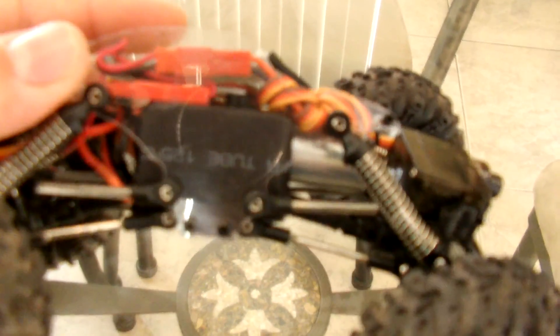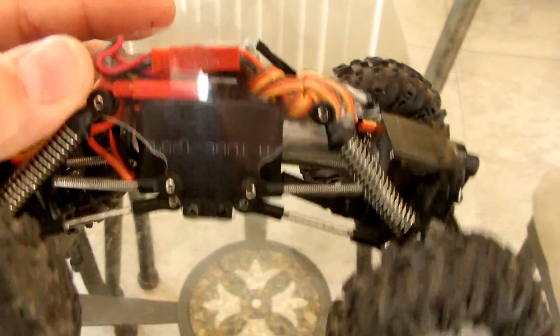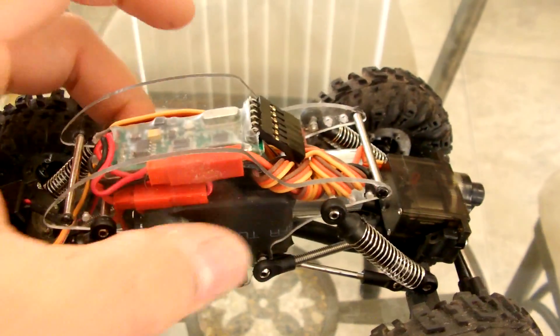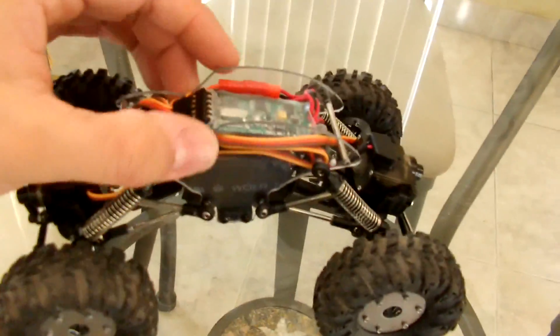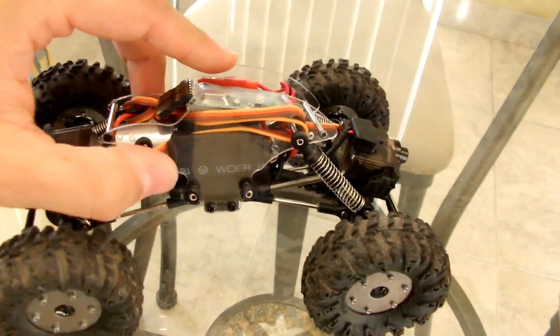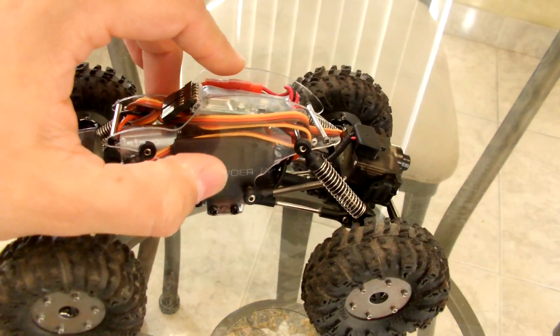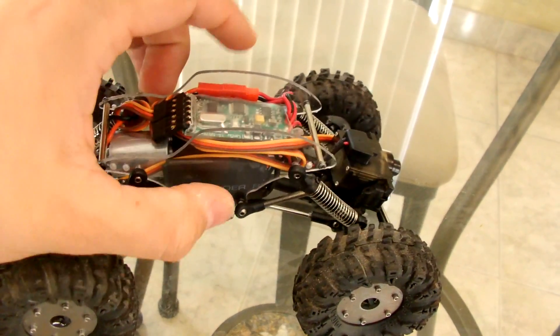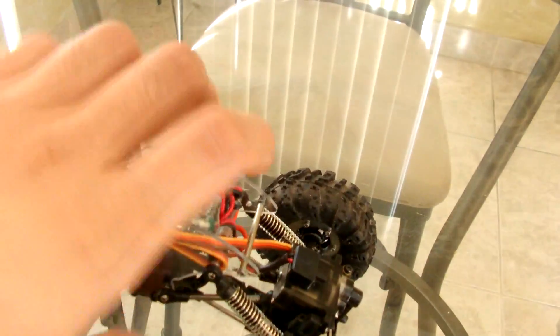It's a really small chassis — as small as I was able to make it — but it's also big enough to fit all your electronics in there. These black little pieces you see on the side, that's actually my battery. On this setup, I'm actually running 250 milliamp 2S batteries. I just put one cell on this side and the other cell on the other side with red wire, which connects the cells one to the other.